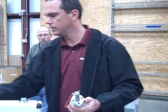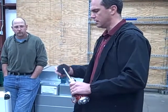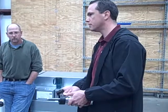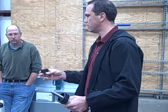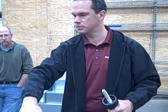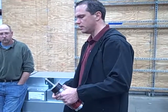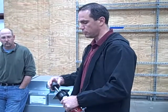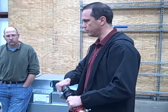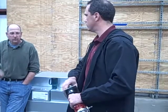There are two real advantages to this set. The first is the drive, but the second are our cups and cutting dies. Our cups and cutting dies have alignment lines on both the cup and cutting dies. It's a shallow three-point cutter, which doesn't look too aggressive, but when we do an actual knockout, you'll see it's got a really good benefit to it. There's a little bit of recessed threading on that draw stud, which helps to seat and thread your cutter a little bit easier, but it also prevents you from losing your threading if you were to tip over and drop your knockout.